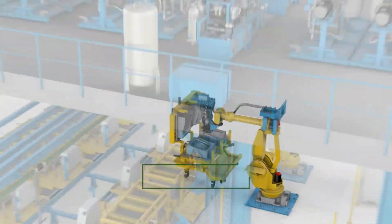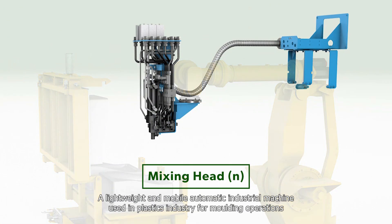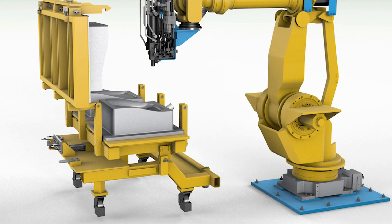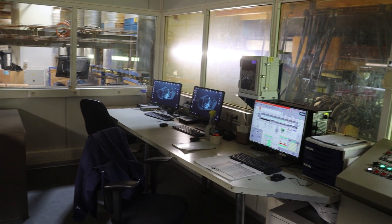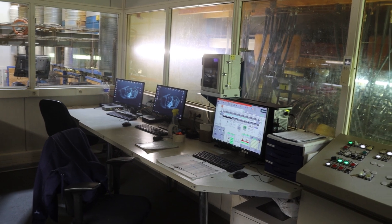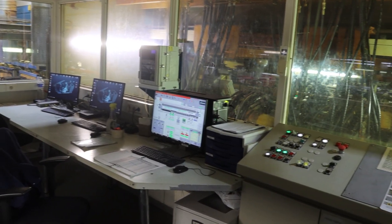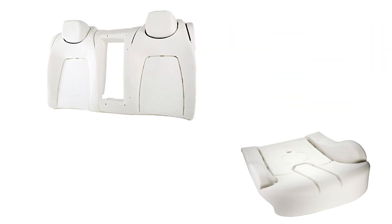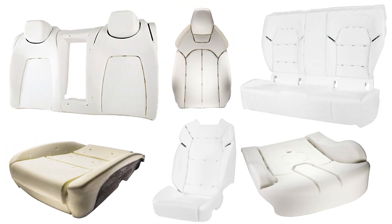A mixing head is a lightweight and very mobile automatic machine. It pours the mixture exactly where required into moulds according to a predetermined pouring pattern set by computer and linked with part design. The mould is made of two parts that fit together perfectly and is designed to create the shape of the seat pad.